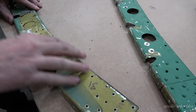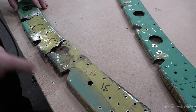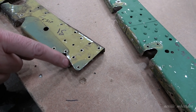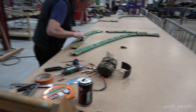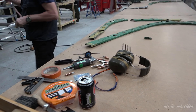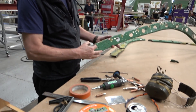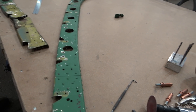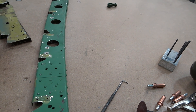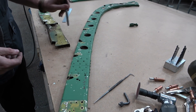The violent nature of the way this thing — the roof collapsed on it — you can actually slightly lose position. Now that's in, I'm going to mark out those two holes and also these notches here, and that rebate there for the end. You've got to fetch it out and mark it up. These frames — there's a lot of faffing around with them. Every time you do one, you've got to do those notches, and each one of these stringers has got a little cleat on it there as well. You've got to leave a place for that — all those to drill. Every single stringer has got a cleat that attaches the frame to the stringer. And also these holes here have got to be transposed as well.